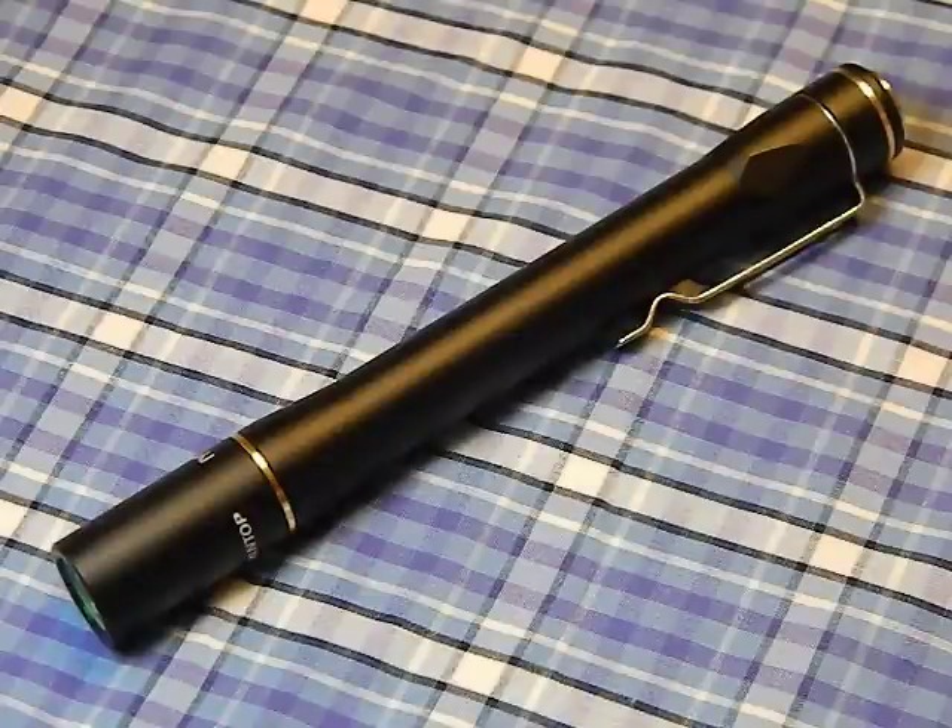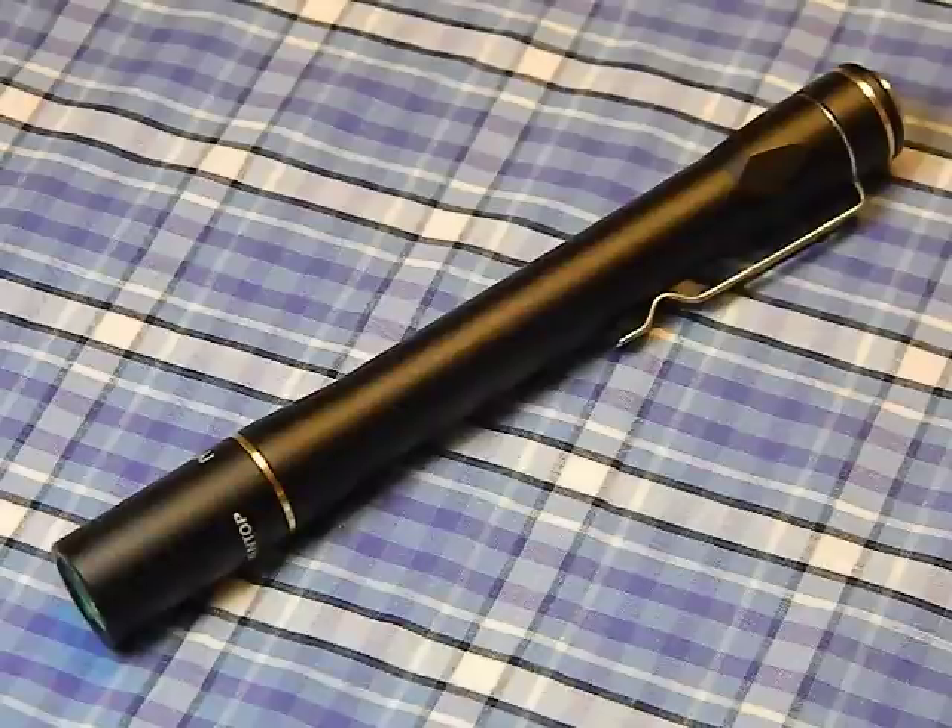This thing comes in two different configurations: one using the Cree XPG2 LED, the other using the Nichia 219b. To make it simple — if you go with the Cree XPG2 it's a stronger LED but has a very normal cool white tint. If you go with the Nichia, it's not quite as powerful — you're only losing about 10-15 lumens — but the Nichia has a much better color tint. They're well known for a very attractive tint, especially for people who are sensitive to tint color or read a lot with flashlights. So consider it this way: more power with the XPG2, better color with the Nichia.